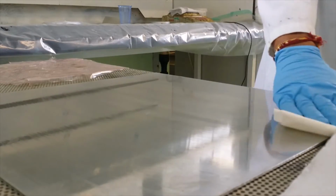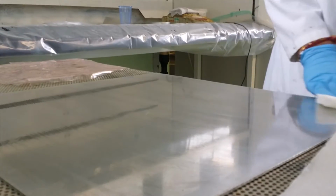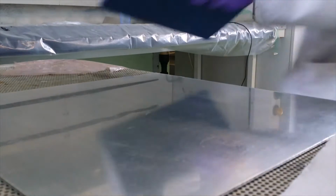Okay, so let's say that this plate has not been applied with the mold release agent. No, the clean, the mold cleaner. So before we apply this agent, we have to apply the mold cleaner, isn't it? Yeah, you have to, so clean it 3 times. 3 times. Okay. Until the surface is smooth, yeah? Alright. Do you want to apply it last time? Sure. Great.